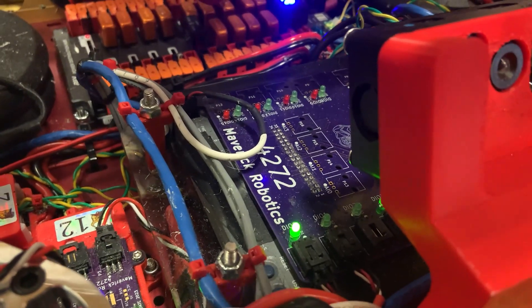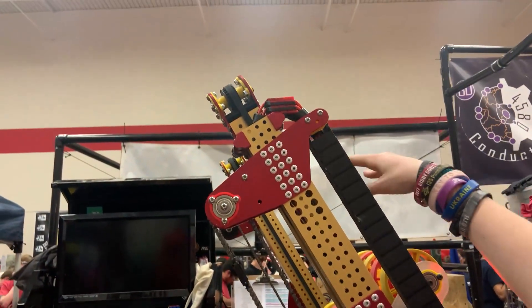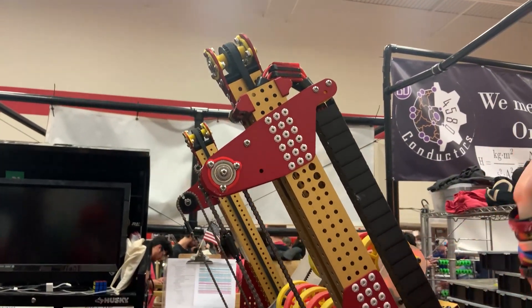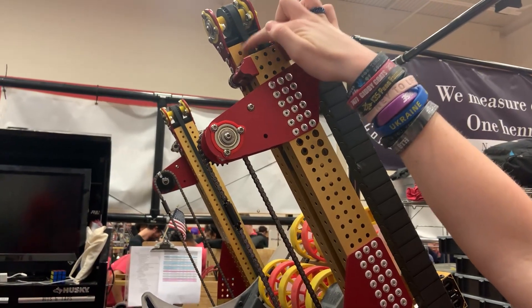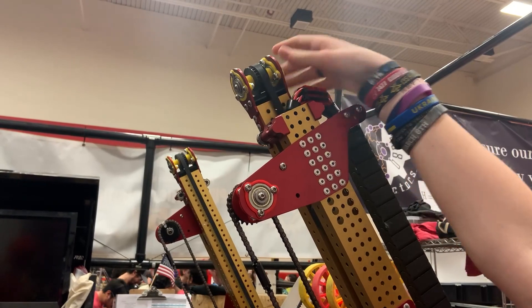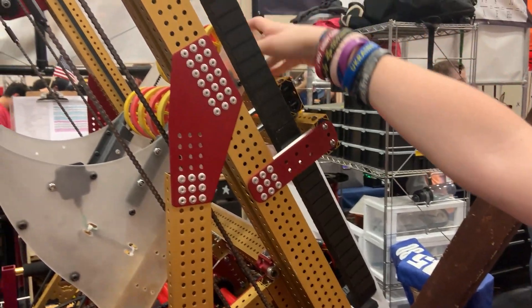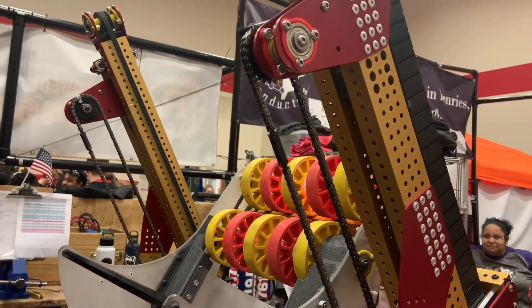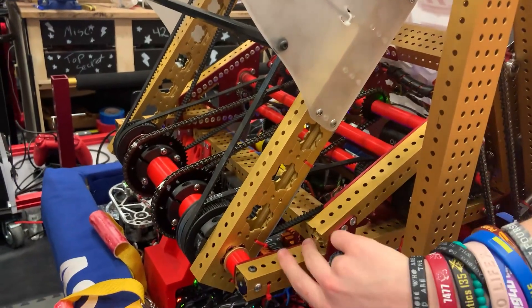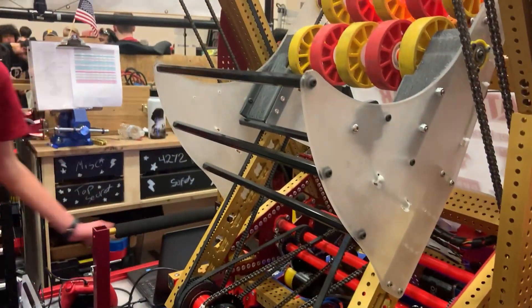Next we have our elevator. It is a two-stage cascading elevator, but if you'll look at the top here, it's actually headless — that's because our arm swings out and it would swing through the head if we had a top to the elevator. So we had to design the rigging so that it went inside, and instead of ropes we used belts, because that also helps our robot be indestructible. Here we have our wire chain that's also mounted to the elevator, and then the elevator can go up pretty far — it reaches plenty far to the high nodes. And here we have our arm: we have a static part of our arm mounted to the elevator, and Connor actually designed this intake if he would like to talk about it.